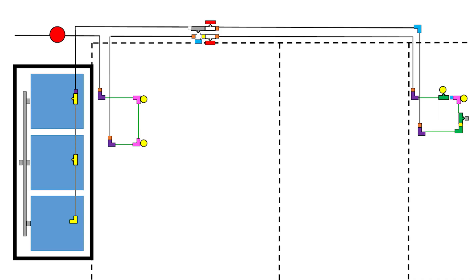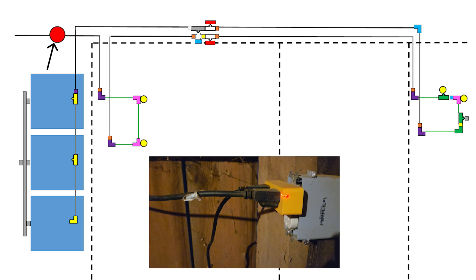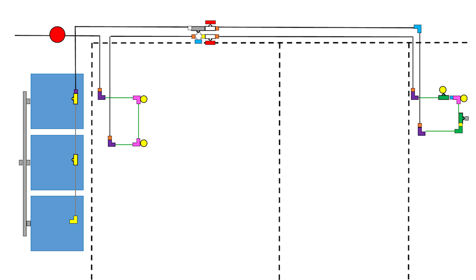As you can see over here on the left, we have our three IBC totes. Those are coming out to the gray pipe which is our PVC, and then out of the PVC we have the three quarter poly line going to the red circle which is our pump. That pump is going to be plugged into an outlet that turns on at 38 degrees Fahrenheit and turns off at 50 degrees Fahrenheit. So whenever I'm in danger of freezing weather, the pump and heating element will turn on and then self turn off when the temperature is appropriate. As you can see, this circuit comes down, loops through the first stall, comes to a junction of a bunch of ball valves and diverters, and then runs down to the other stall.